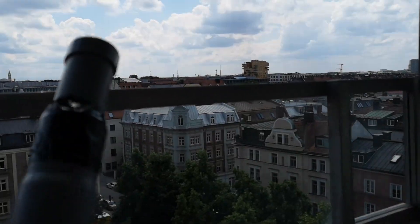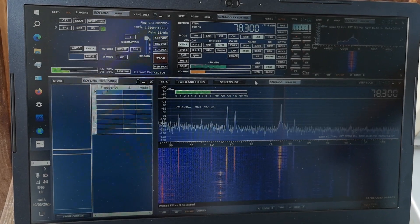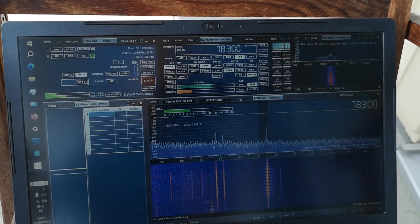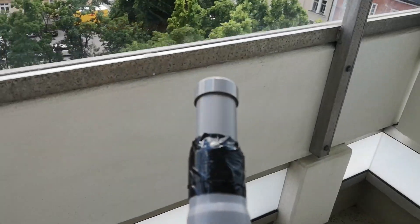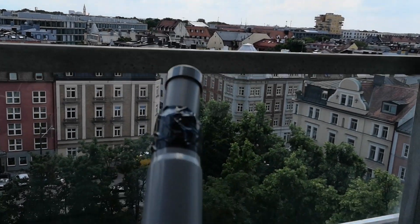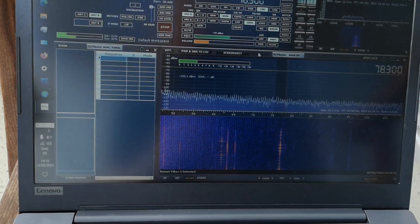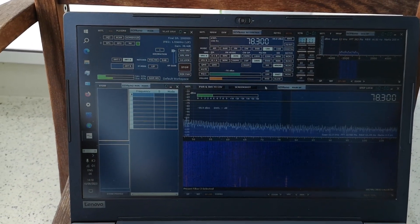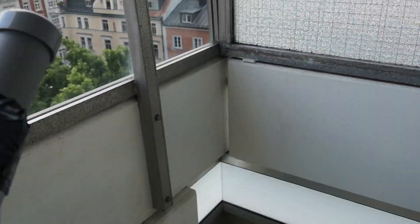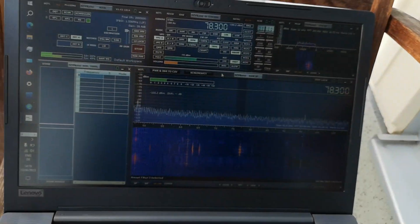Moving the antenna around, there's a bit more signal. Then putting it out into the fresh air - you see that as soon as you put the antenna out by just a few centimeters outside the building, the signal level really increases. When I bring it back in, that's inside the balcony space. Moving from inside to just outside is only about one meter, and it makes a huge change in signal strength. The building acts as a Faraday shield because it has reinforced concrete with steel or iron bars, which absorb a lot of signal especially at lower frequencies. Just poking the mini whip a few centimeters over the edge of the balcony makes all the difference - it's amazing. Something else we learned - more to follow, remember to like and subscribe.